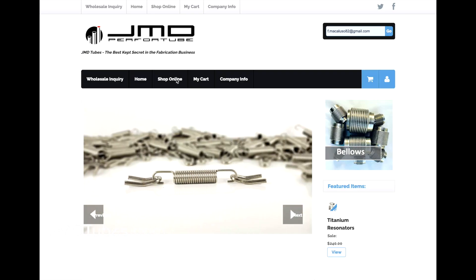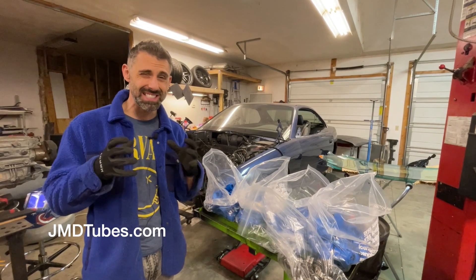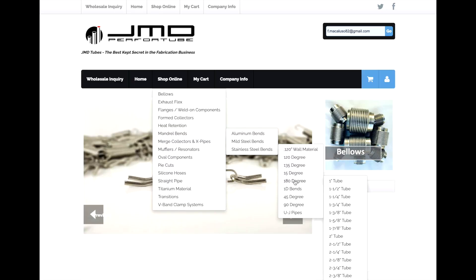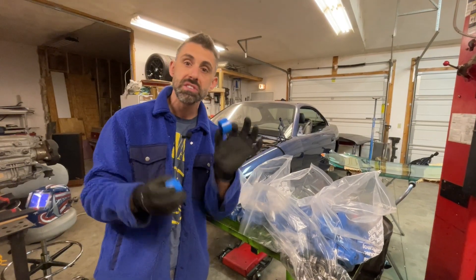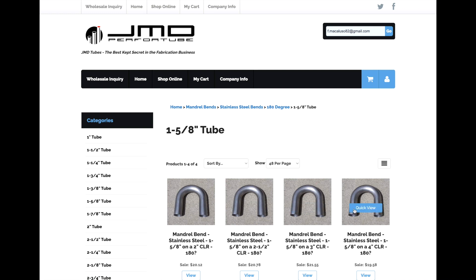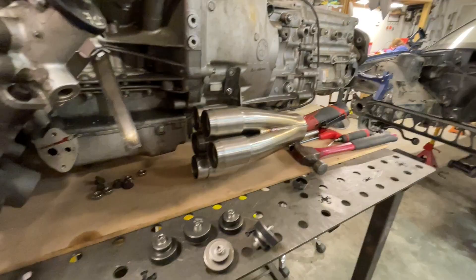The link is down in the description so you guys can see how to purchase these. We're going to be using stainless steel 16 gauge tubing for our primaries, and each of these blocks has a 1-inch centerline distance. Whether it's a 2-inch radius or a 4-inch radius, they all interlock with each other to create a dummy tube for us in order to create our primaries.